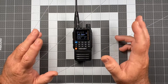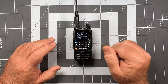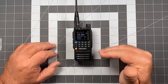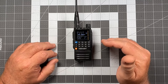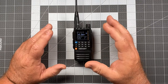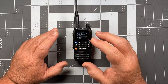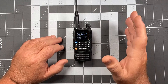Squelch adjustment is something that you don't have to do that often, but in the initial setup of the radio and getting to learn the radio it's something you're going to want to tweak and play with a little bit. Essentially all squelch is is applied to the radio to filter out unwanted noise and unwanted signals. You can apply the filter from a level of zero all the way up to nine, with zero being no squelch applied whatsoever. The idea is you're going to filter out unwanted signals and static. The problem with squelch adjustment is if you get too aggressive with it you can make that filter so powerful that it won't let even strong signals in.